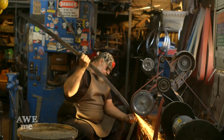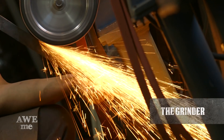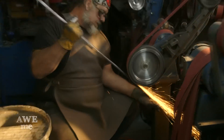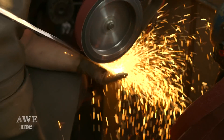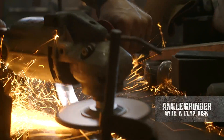I've got the blade profiled to a shape I like and I've started grinding the edge bevels and getting everything set. I'm also putting kind of a triangular cut on the spine of the blade, which is more traditional for katanas. I was at the grinder for probably about eight hours just finishing everything up. It's just a big blade — it takes a lot of time to grind it. I've had Brian working on the sides of the blade, on the bevels, with an angle grinder with a flap disc, just keeping everything relatively flat.